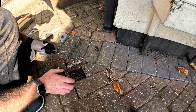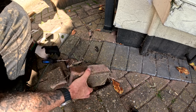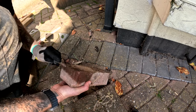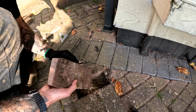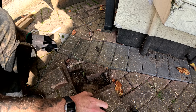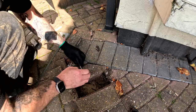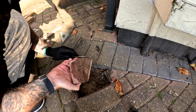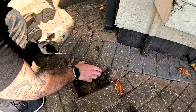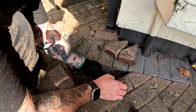Identify the area that needs lifting and just take out the blocks you need. Don't start doing the ones around them if they're already set and in place. When you take them out, it's good to sweep off the debris and bits of sand touching them — it'll make them go back in easier.